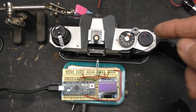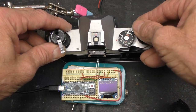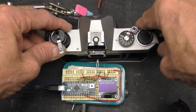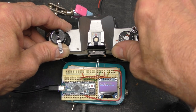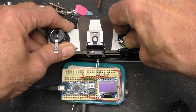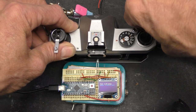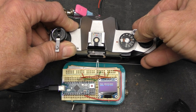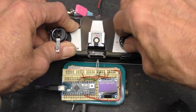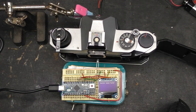This is a K1000 Pentax — the lens is off, but the light's still going to go through the focal plane shutter. I've got it on 1/500th of a second. One 357th — it's off for sure, and I knew this one definitely needs work. If I go down to the slower speeds, this should be a half second and it's like one 156th. The one second does a quarter of a second. And at 1/60th of a second it's reading 1/50th, so all of those slower speeds are way off.